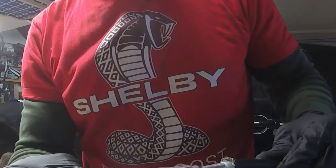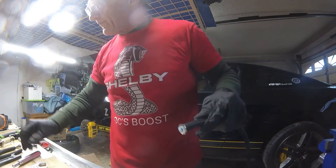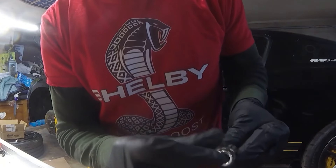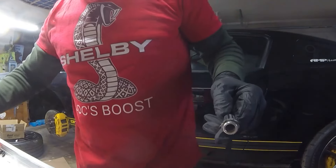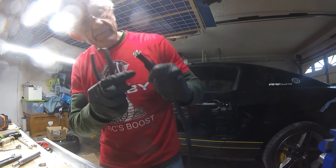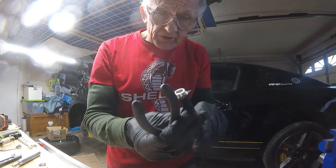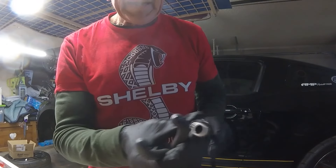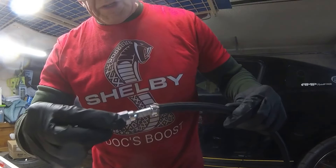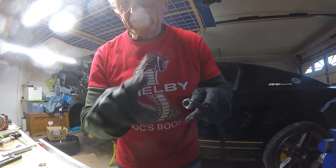When you buy the kit it comes with a tool that helps get that tube round. Take the ferrule and push it down in there — we're almost to the edge. I take the rubberized edge so I don't damage the surface and tap it on there until I can no longer see a space on the inside. That looks pretty good — I got a really good cut and got it down in there. This just pushes inside, but before we do that we want to shove that down in place. That'll create a tight seal against those ribs.